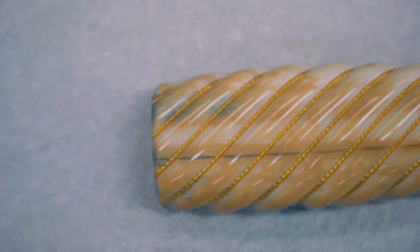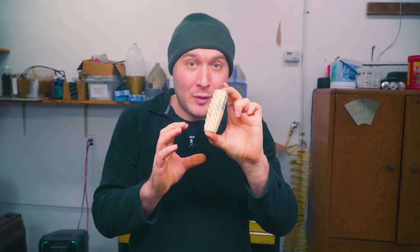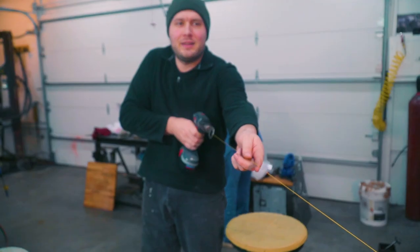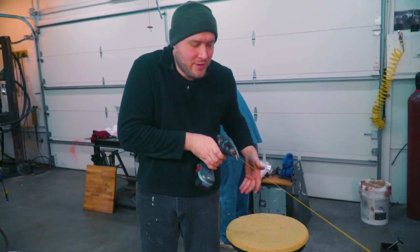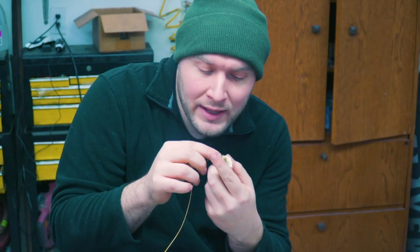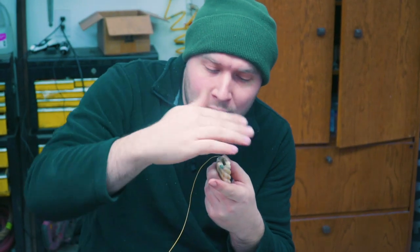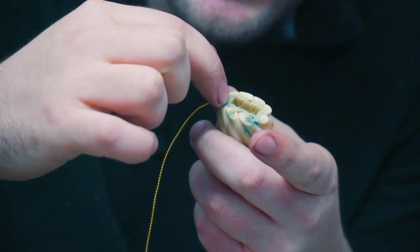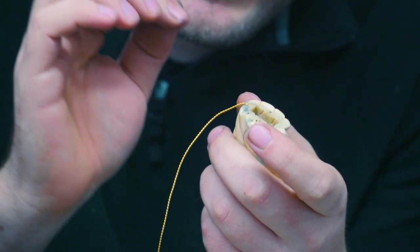Today, I'm going to show you guys the process of putting this 24 karat gold twisted wire into the fluted handle we're working on. 24 gauge, 20 thousandths, 24 karat. I like to overdo things. If you want to do nice MasterSmith quality wrap, make the groove on top where the wire goes over the end of the handle. Make that groove just a little bit shallower than your gold and smash the end of that gold as you wrap it around there — that'll give you a really nice fit up against your spacer.